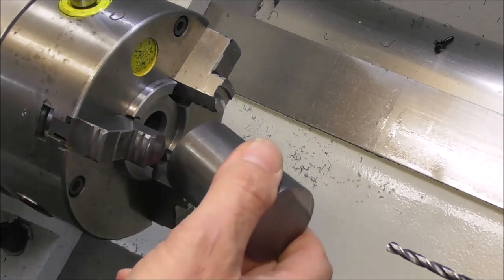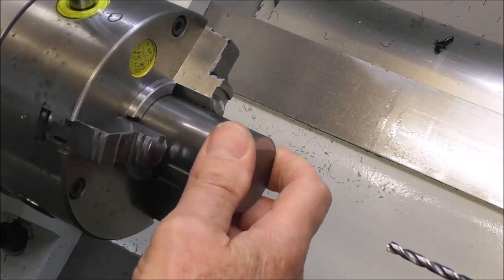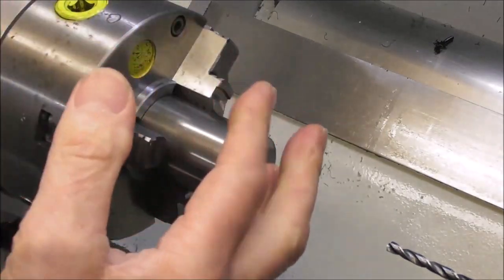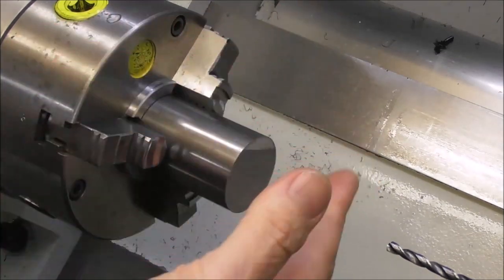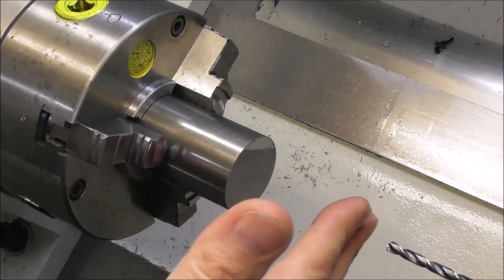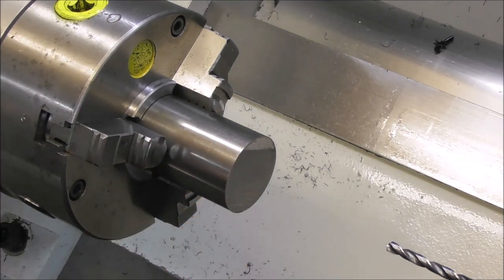Then as you set each part in, you set it up against the chuck parallel or spider, tighten it up, and now you've got location lengthwise and much more secure seat because it's sitting on the end and in the diameter. It's holding it parallel and square, axially and radially in line, and it can take much heavier forces for rough machining and parting. You're much less likely to have a part moving and accuracy issues.